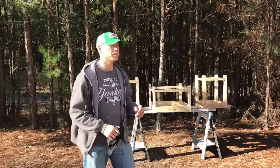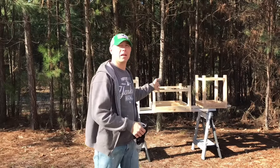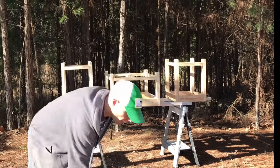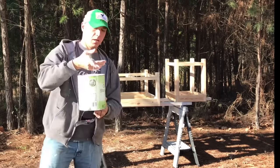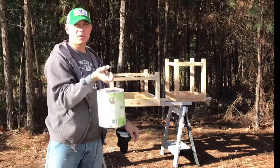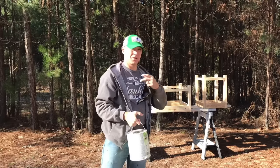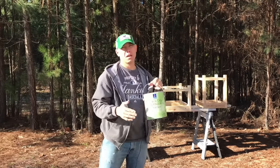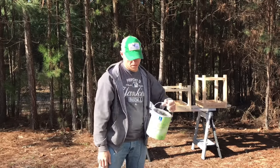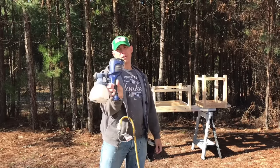Now it's time to paint the frames. I've got a whole set here I'm building — a coffee table and two end tables. What I like to use is Sherwin-Williams quick-dry stain-blocking primer. It works really well at blocking the knot holes on pine because a lot of times they'll seep through the paint. You pick it up at Sherwin-Williams — it's about $20 a gallon. I'm going to be putting it on with my HomeRight Finish Max Super sprayer.